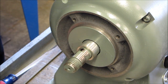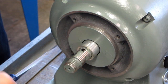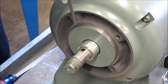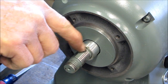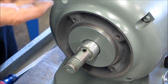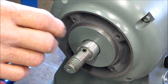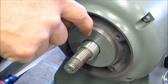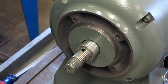So this is my plan: take that center bore of that roll pin and drill through it. I just happen to have a piece of rod that's slightly smaller than the 5/32nds drill I'm going to use. I'll put it through the bottom, cut a short piece of this rod, and take some silicon bronze to braze the top of this. This is a heat treated spring steel roll pin. In my past I've had good luck joining it that way — the heat will probably anneal or soften that roll pin as well, hopefully not make it brittle at the edge. We'll be able to lightly tap that roll pin out and then pull that sleeve off. Let's see if my plan works.